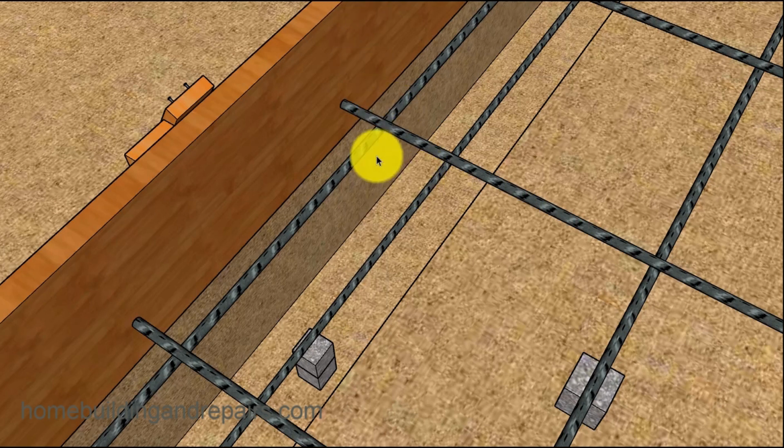Let's go ahead and get rid of our support brace. If I wire this and then run some wire down, wrap it around here, then this cantilever here will actually support this. Now, I'm not suggesting that it's going to do it all the time. And if that's the case, you might need to put another brace up on top or run some wire from the top of this. Drive a duplex nail into here and then have the wire come down, and then do the same on the other side.